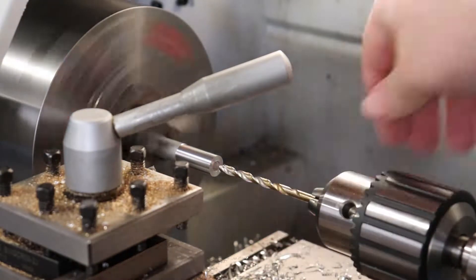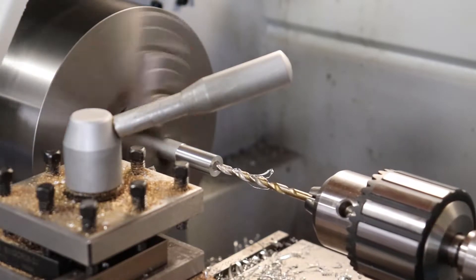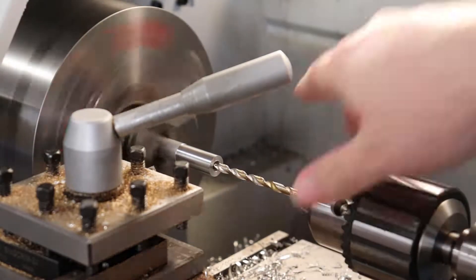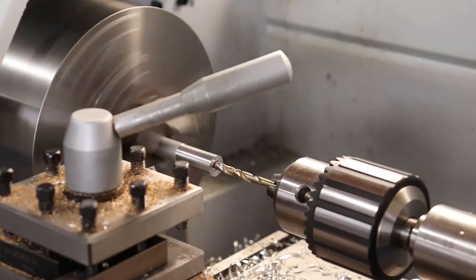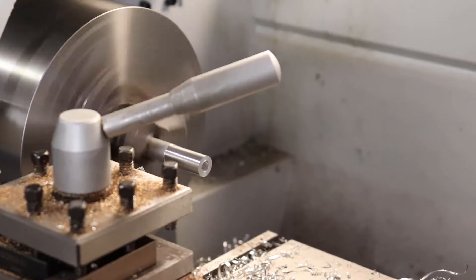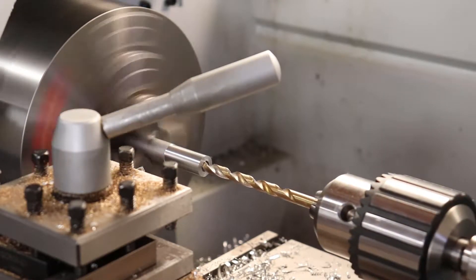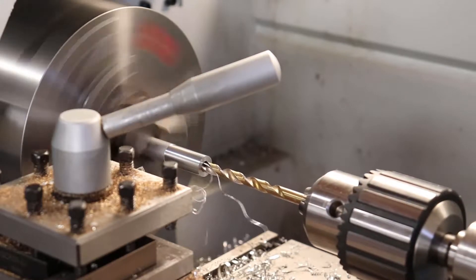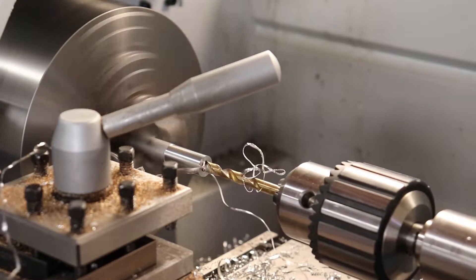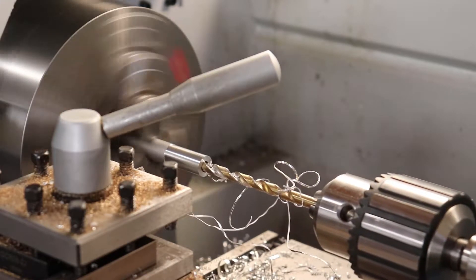Next, I use a center point drill to make a small hole in the center of the rod. Here I'm using a 9/64th inch drill bit to make a hole — I just had it lying around. Next, I'm using a quarter inch drill bit to make the final hole. I'm being very careful to count how many revolutions I crank the tailstock, making sure the drill goes far enough but not too far. The reason there is a quarter inch hole through all these spacers is because there's a quarter inch stainless steel rod which goes all the way through the display stack to support the entire structure.